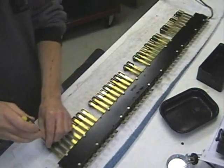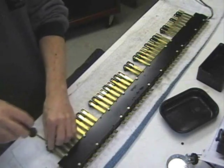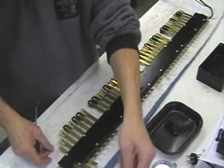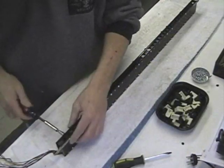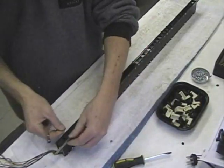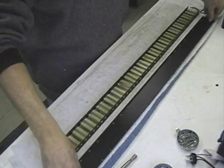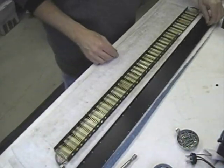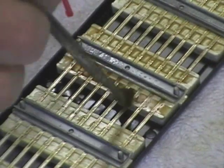Back to the drawbar assembly — what we're going to do is first take the keys off and the drawbar buttons off. They're simply held in place with a screw on the bottom. I do this so I can clean everything very thoroughly. Next, remove all of the screws that have nuts on the bottom of them. When you look at the underside of the drawbar, you'll see. It would be a very good idea to draw a schematic or make note of which screws go where, because when you put it back together again it'll make it a lot easier.